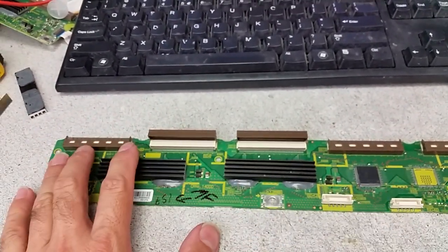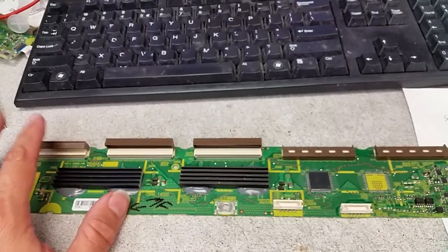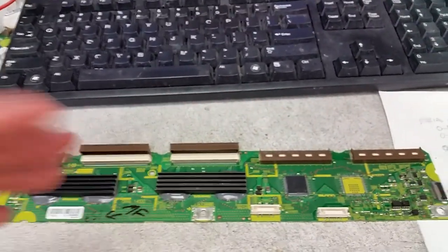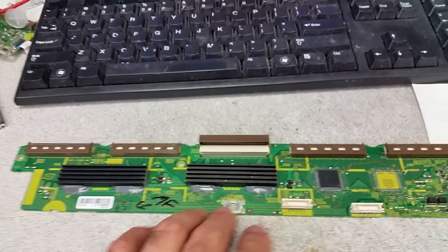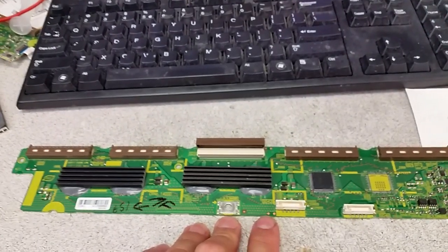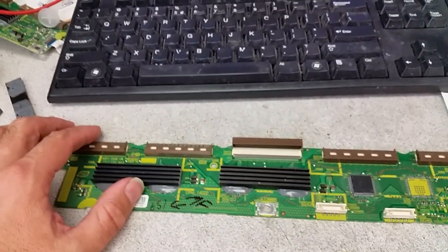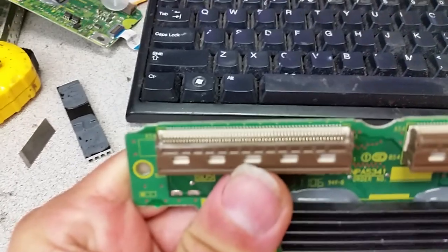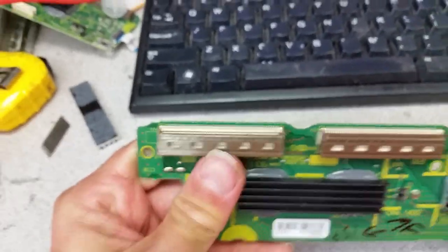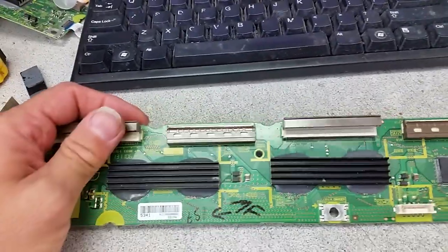to the panel. And what this buffer does is it takes in all the information about which lines need to be set up with high voltage or clear down. And so many times per second, it sends that output voltage, which is high. It varies between, let's say, roughly 270 to minus 160 volts relative to something that's called floating ground. It sends it for every single line out of that buffer here, out of that connector. Every single one of those pins has a different value, which again has only a few distinct digital values, but they change so many times per second.